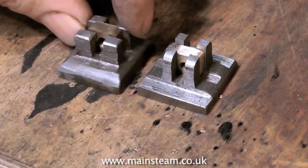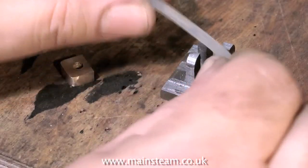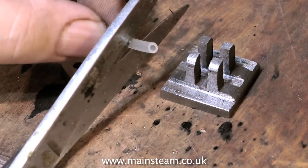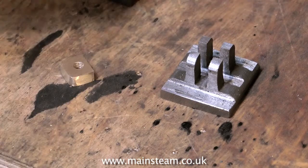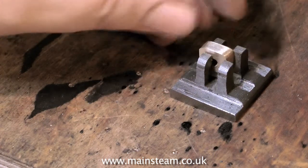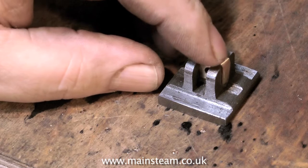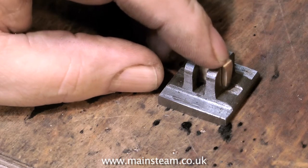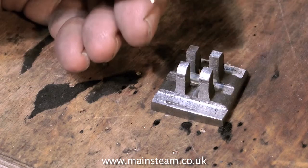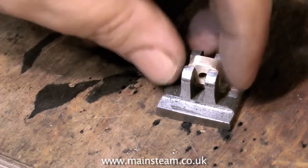These brass parts must not be a tight fit in the valve. If they're a tight fit they're likely to hold the valve off the port face. Here's a useful tip: slide valves in a vertical plane sometimes do not slam onto the port face when steam or air is admitted. So I give them a bit of a helping hand — I use a piece of silicone rubber like you can see here, which effectively holds the valve against the port face. I would only do this in a collector's stationary engine though, not in every engine. On a locomotive it would not be desirable unless fitted with a sniffing valve, which is a vacuum relief valve — it is advantageous for the valve to fall off the port face to stop the cylinder from vacuuming.